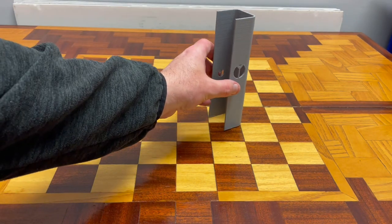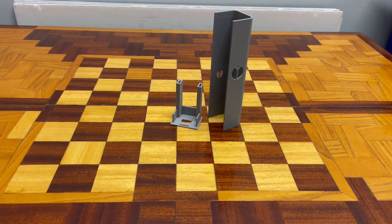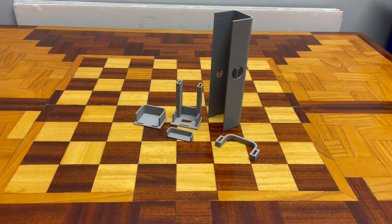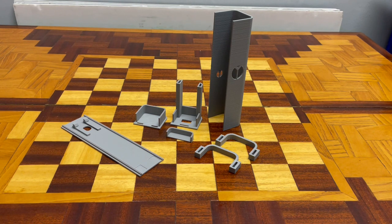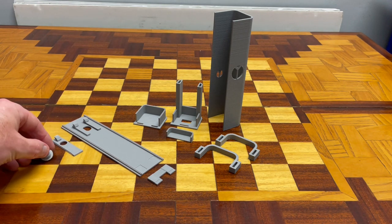Here are the 3D printed parts for the controller. I decided to model it in pieces so that I can be sure that there won't be any problems with 3D printing, including but not limited to overhangs. I can glue these pieces together myself. You'll also notice that, for the holes on the controller shell, there is a Y formation. The reason for this is to provide some support for the layers above the holes while the outer shell is being formed. I can cut out these holes myself.